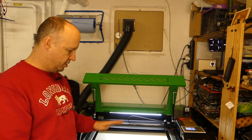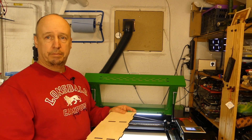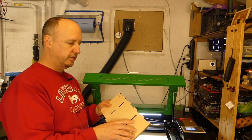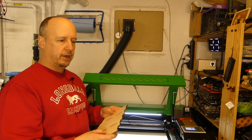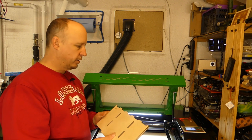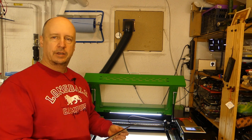It wasn't as bad when it was new, but I think it's basically just settling on this not 100% flat floor, and it could be that it had some tension when it came here that has now disappeared, leading to it being slightly off by a few degrees. It's not bad — I can still do a lot of easy patterns, laser boxes, ornaments, and they'll come out just fine. It's just that when I did the Amiga case, for example, I was seeing this error being more pronounced — because the parts were a lot bigger and I usually align my parts to the x-axis. Had I aligned them to the y-axis, the error would have been not as pronounced and probably even negligible. But let's try and get it fixed.